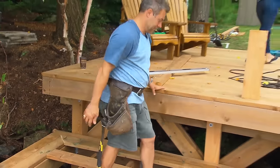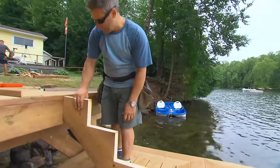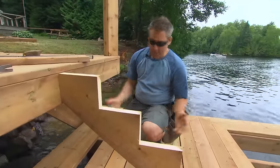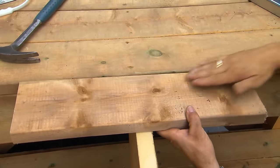Tom's deck is 18 feet across, and we decided with all the people that come and go, it'd be nice to make the stairs all the way across at 18 feet. That's the stringer layout — this will be our template. We set the ledger board at the correct height, and now you can see why: we have four equal steps coming up to a finished tread and right here it's perfectly flush.